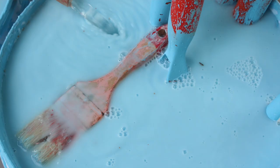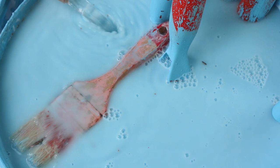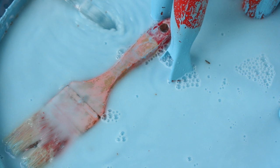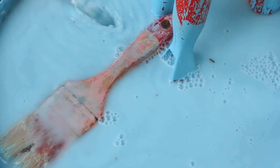Store your solvent-based (oil-based) paint cans upside down to prevent a skin from forming. Don't store your paint where it's too hot or too cold. If you need to dispose of paint, find out from your local environmental agencies where you can properly do so.